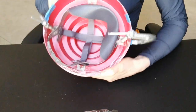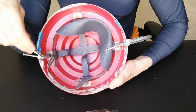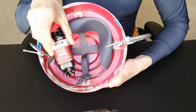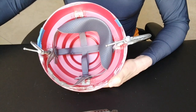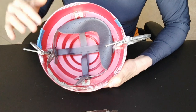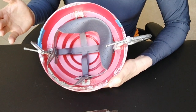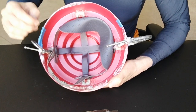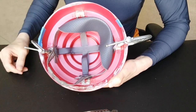Now it's time to wait another two hours or so. After gaining some experience, I've found that with this particular glue it's nice to unclamp it and then use a knife to trim off the excess while the glue is still a little soft — it's definitely set, but still a little soft so it's easier to cut. You may want to take advantage of that.